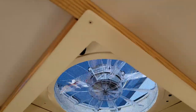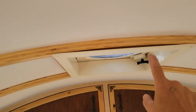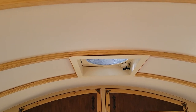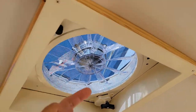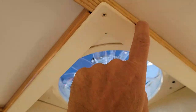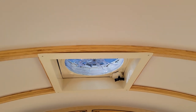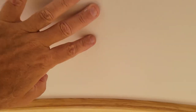I put a little cross brace on either side across here. I was going to cut a curved piece to fit in here but it's such a small gap — only about a quarter of an inch — so I don't think I'm going to bother. The housing I built on top screws down into the beams from the top, squeezing everything together, and that's what seals it, along with the construction adhesive.